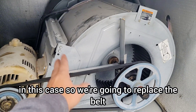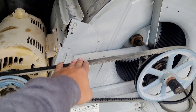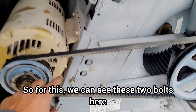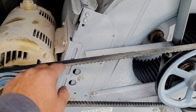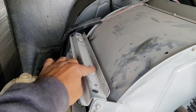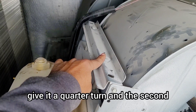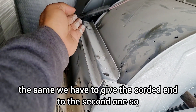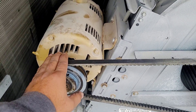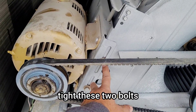We're going to replace the belt and adjust the tension. I have replaced the belt — as you can see it isn't very tight, so we have to adjust the tension. We can see two bolts here; loosen those two bolts, then use another two bolts to adjust the tension. Rotate them simultaneously and equally — give each a quarter turn at a time — so the pulley does not become angled. Once we find the right tension, lock those two bolts tight.